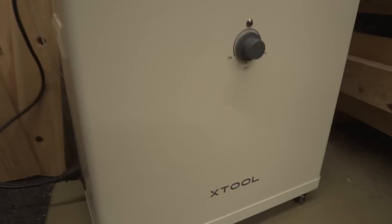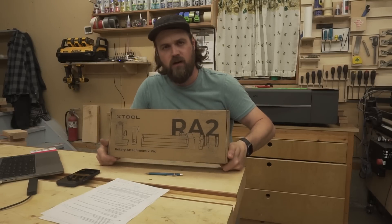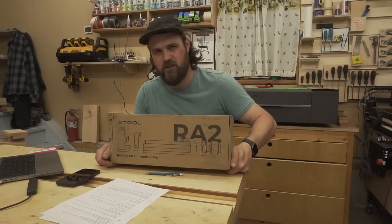I really enjoy this laser, and you can see it's already got a permanent spot in my shop — I'm committed to it being here for a very long time. The lifespan of the laser is 6,000 to 8,000 hours, so we'll see about longevity. I think the smoke extractor is an absolute must unless you're able to plumb the exhaust directly outside. The P2 also has some interesting accessory options: a rotary, which I have; a riser, hopefully on the way; and an auto-feed conveyor system for longer material, which I'm not interested in. From the time I started this video until now, about a hundred other review videos have come out and we're all saying the same thing — if there was a serious fundamental flaw, one of us would have figured it out. If you're in the market for a laser, this is a solid contender and I'm really excited to see what I can do with it. Until next time, thanks for watching.